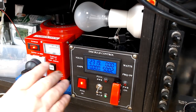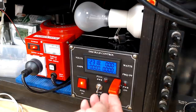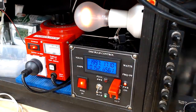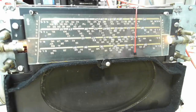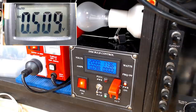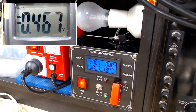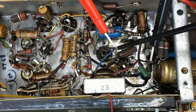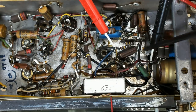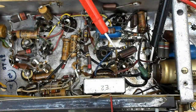I'm on the dim bulb and the bulb is working as expected. Lights on the front panel are showing. The plate is reading — nothing — no voltage on the plate. I'll turn it off. The transformer's probably open. Lifting the lead off the output transformer valve and putting my meter across the two primary leads — it's open circuit. That output transformer is open circuit.